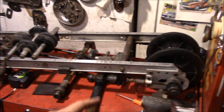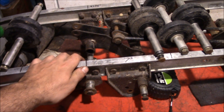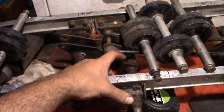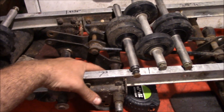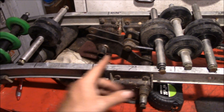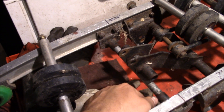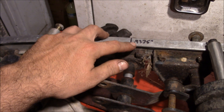However, we're making our own suspension here, so we don't have to follow no rules. Well, we do have to follow some rules — basically where we're going to have the front set of idler wheels. We've got all these extra ones to add along the way, but there are a couple of stock mounting locations around the front suspension arm pivot. There's so much stuff going on there it's really tough to add anything extra right in that area. So we're going to put a couple of stock idler wheels there, and those idler wheels actually stick up above the rails about 7/16ths of an inch.